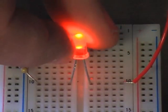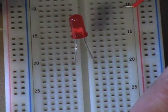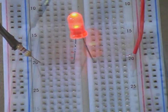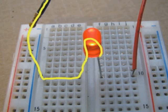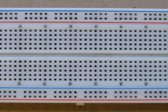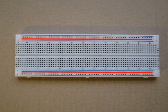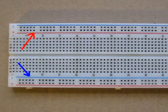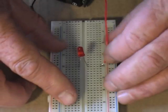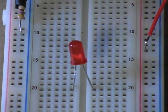Move your LED to a different row and reconnect it by connecting the battery leads to that row. If your LED doesn't light, check the LED — it might be backwards. Building complex circuits requires multiple battery connections, and breadboards have a nice feature that makes it easy to connect to the power supply. The long rows of holes beside the red and blue lines on the board are power lines. A long metal conductor runs the full length of the board under each row of holes. To energize the power lines, plug the negative black battery lead in beside the blue line and the positive red battery lead in beside the red line. It doesn't matter which hole you plug into — all holes in each power line are connected.